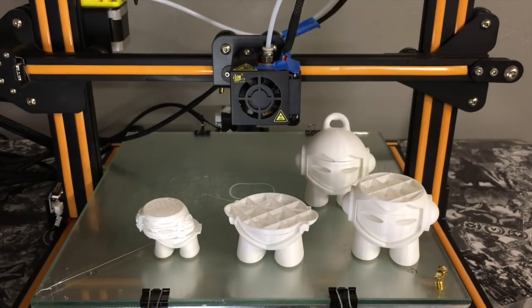This is what causes the slipping of the filament once you have a partial clog and it's trying to print through, and that's what people mean by slipping, because the gear's still turning and the filament is skipping, not going through, but it's not the actual filament. Sometimes maybe just the teeth on your gear or pulley is bad. So go ahead and keep an eye on that. Check that next time. Maybe you have the same issue and you're just going crazy, you can't figure it out like I did. And this thing's very easy to remove.